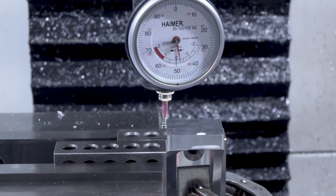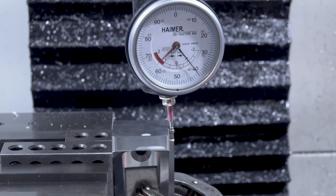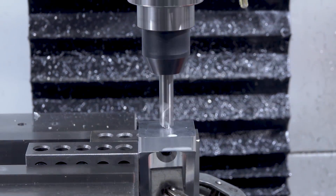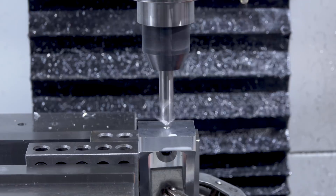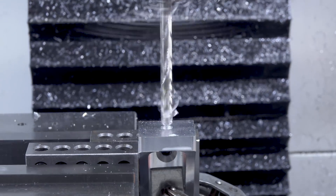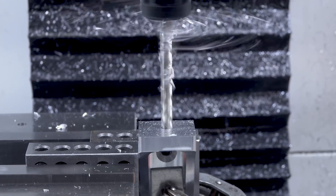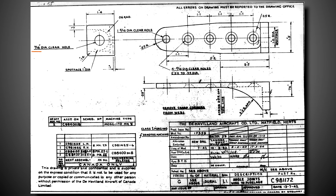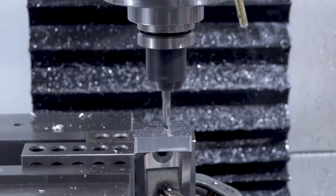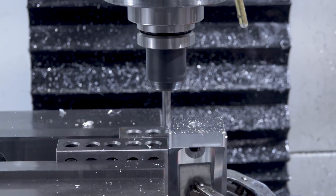The bigger problem is this is where we start to make the major mistake: we held the tolerance of thickness, but the part doesn't remain flat. Flipping the part up and holding it against a 2-4-6 block with a kant-twist clamp and a shim just to protect the surface finish — this was the second mistake. We should have choked up higher on that clamp and used more clamping pressure. You can clearly see on video the part deflecting during both the spot and the drill. Luckily per the print it's just a clearance hole, but still — not a good example of reliable, safe workholding, especially on a part going into an airplane where the stakes are high.